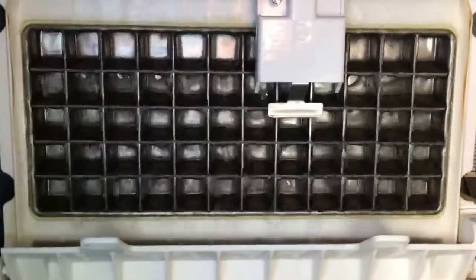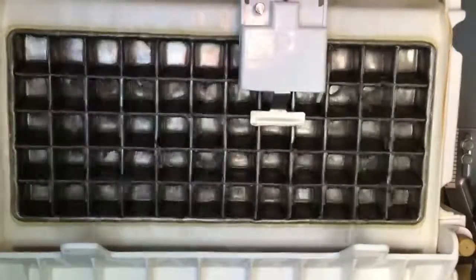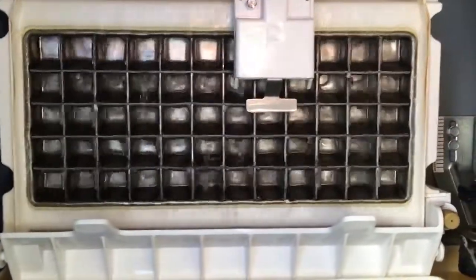Easy way to remember the difference between a condenser and an evaporator is that when you sweat and the sweat evaporates in the sun, you get cooler. I used to be confused about the difference between the evaporator and the condenser for a long time until I came up with that not very clever mnemonic.